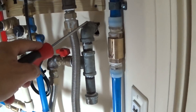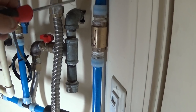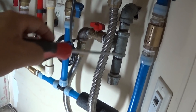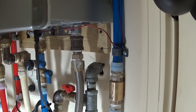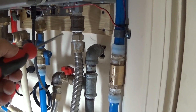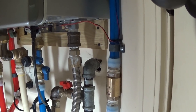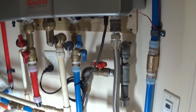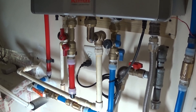As far as the gas — here we have LP. We have a two-pound system coming up. We have a regulator on the other side of the wall, so we have at least four feet. It comes into a T, nipple cap, gas valve, and then a high-flow flex up into the inlet side of the gas. No, we did not have a female side, and yes, I am very unhappy with the coupling, but his tankless was busted and leaking. That is your proper piping arrangement with all of the check valves for a dedicated Rinnai Sensei Series RUR unit.